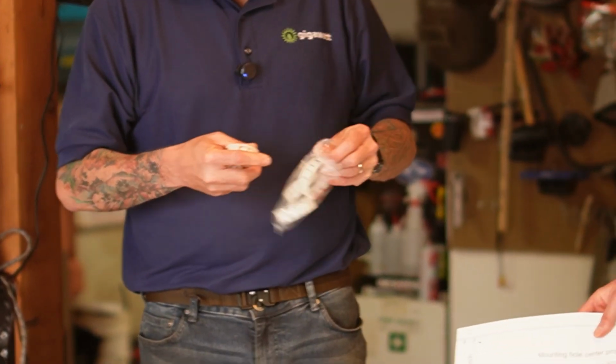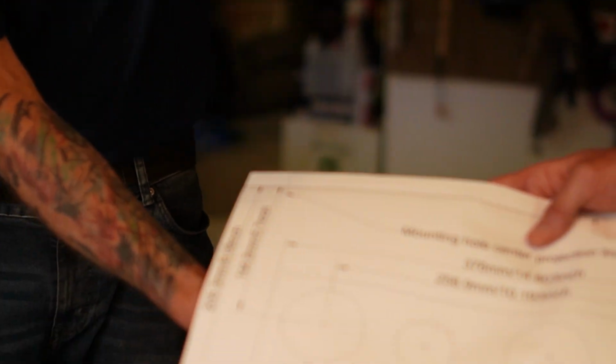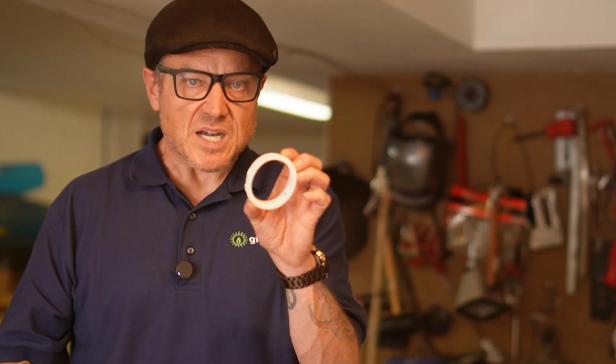You could take the back off and pull the wires out and then stuff them up. Well, things can get crowded inside of the inverter compartment. And so doing the gutter beneath the inverter is going to give us a huge amount of free space to be able to work with all of our inverter wires without having to have it be stuffed inside of the inverter box. If you use an electrical gutter, then you can punch the knockouts into your gutter, and then these poke in from the inverter side down through and into the gutter, and it makes a code compliant raceway. You just need to protect the wireway between the bottom of the inverter and the gutter. And we're not talking about things that are constantly moving and shifting, right? No, it's never going to move again.